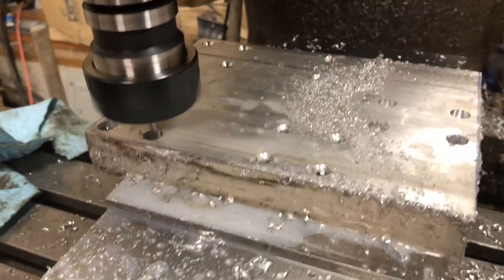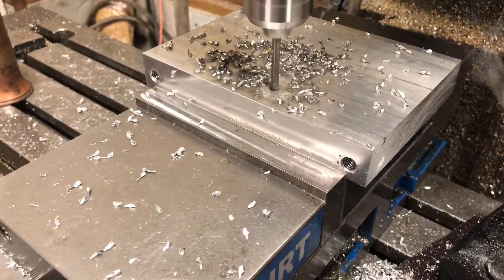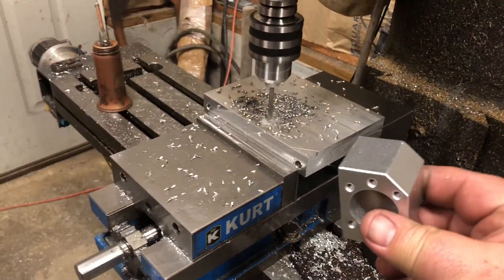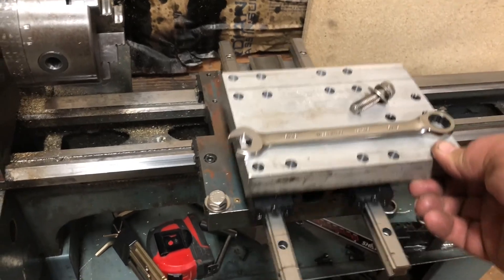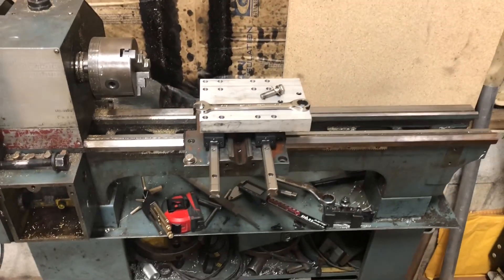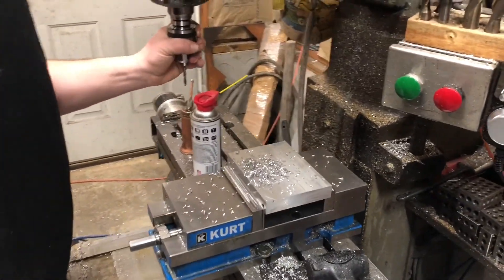We've got our top plate finished. We're doing the side plate for the apron now, with a ball screw nut. We've already drilled the two front holes spaced off the top. We're drilling the four bolt holes for the ball screw nut — it's going to bolt on like that, going over here to the face. This is our top plate and our slide. That apron bolts on here and here; the ball screw nut is going to be in behind. So it's coming together. We're going to have to move these two rails back one more hole to get the distance and travel that we want. Sounds like Brian has changed the tools already — we've got the drilling cycle done.